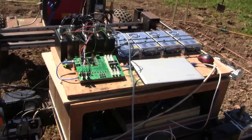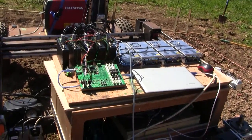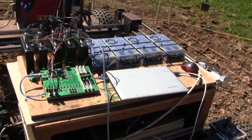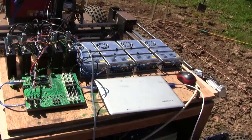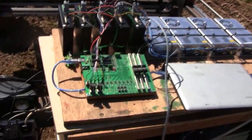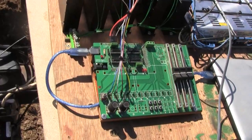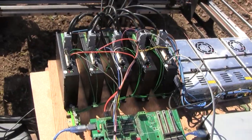I've rigged up this little control panel here at the front — this is just for the CNC. There are four power supplies on the right supplying 60 volts, they're all in parallel, a little slider potentiometer controller, and an Arduino Mega at the back underneath all these drivers.